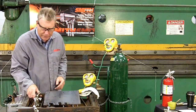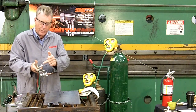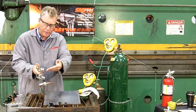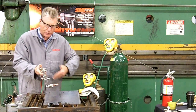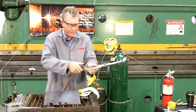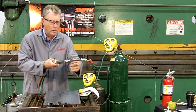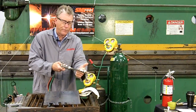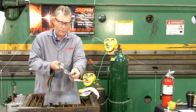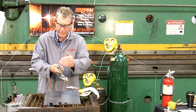We want to bring that pressure downstream. Opening the acetylene torch valve, I'm allowing gas to flow through — acetylene only — five seconds per 25 feet of hose, then shut it off. This is the oxygen valve; open it all the way. Open your oxygen valve on the forward position, five seconds per 25 feet of hose. That way we are guaranteeing we have the right gas in the right place, far enough downstream in the system.